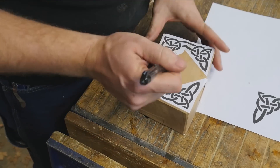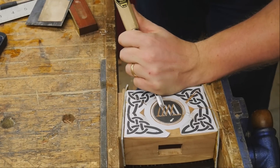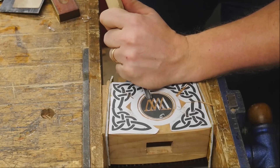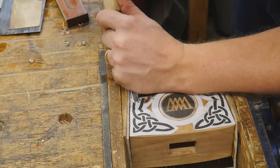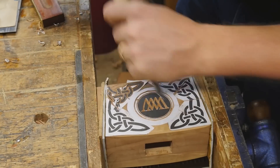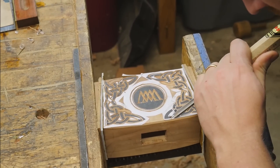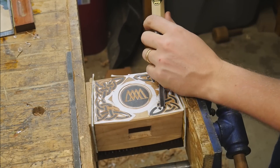But while it's in place, let's do some carving. Before I put it in the clamp, I glued on the patterns I want to use for the carving. Because it's a finishing mallet, I really want it to look nice and sharp and just be finished. I used a glue stick to glue the pattern down, and all of the carving is done with a V-tool — a very straightforward, easy tool, easy to learn and easy to get into carving, especially with the lettering. On all of the Celtic knotting around the outside, I'm just following on both sides of the black line. Most people could pick this up in 10 to 15 minutes. Doing one face of the mallet usually takes around 20 to 25 minutes, so less than an hour to do all of the carving on both sides. I'm really happy with how this came out.